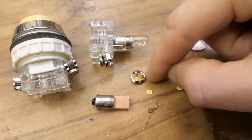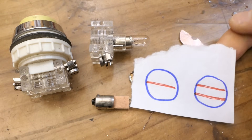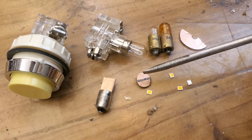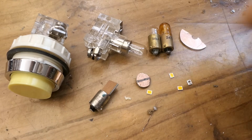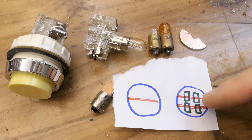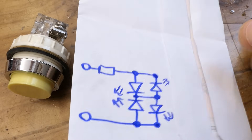This tiny circle of a circuit board — double-sided — one side has one cut, the other side two cuts, so it's basically like this. You can make this notch using a saw. This side will go on to this and the other side has the LEDs on it — four of them, tiny yellow SMD LEDs, soldered on it this way.